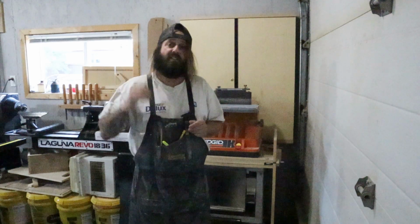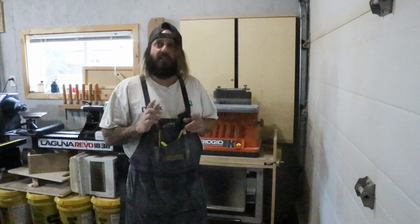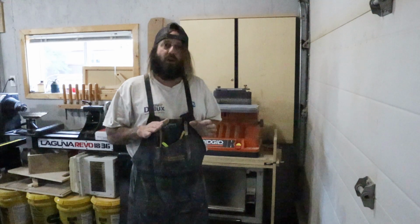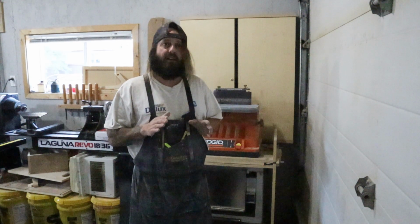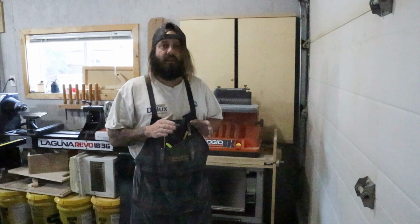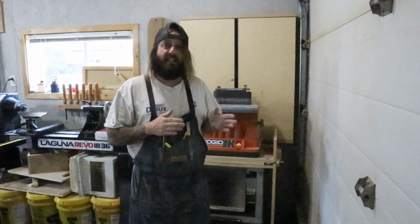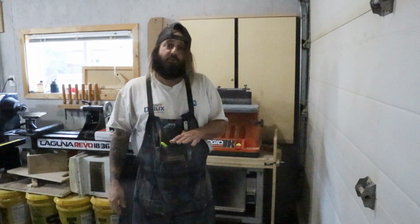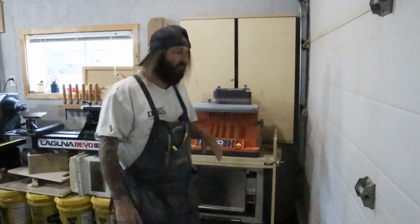And I used it on the ceiling as well. After that, I ended up putting 7/16 plywood on the ceiling and walls. So it's fully enclosed, very well insulated. My heat bill throughout the years is anywhere from $25 to $35 a month. And our winters are anywhere from -28 to -35, 40, and I keep it at room temperature all year round. So I'm very pleased with how I insulated it.